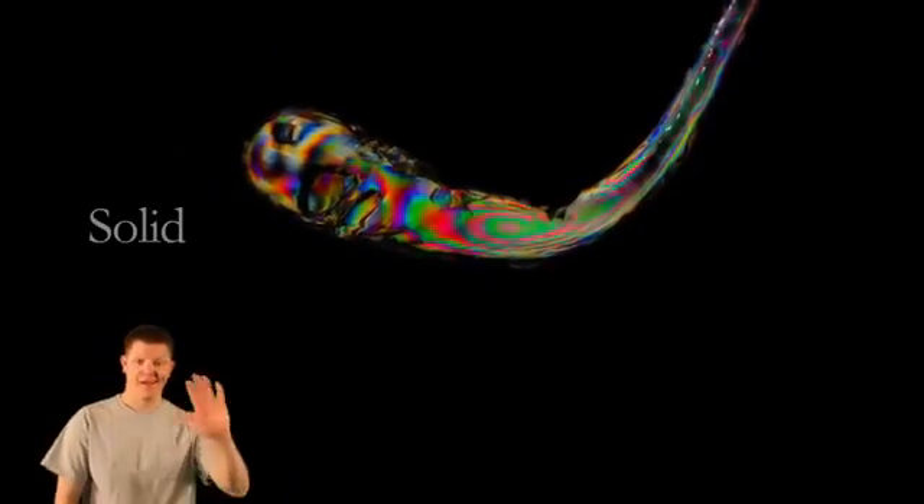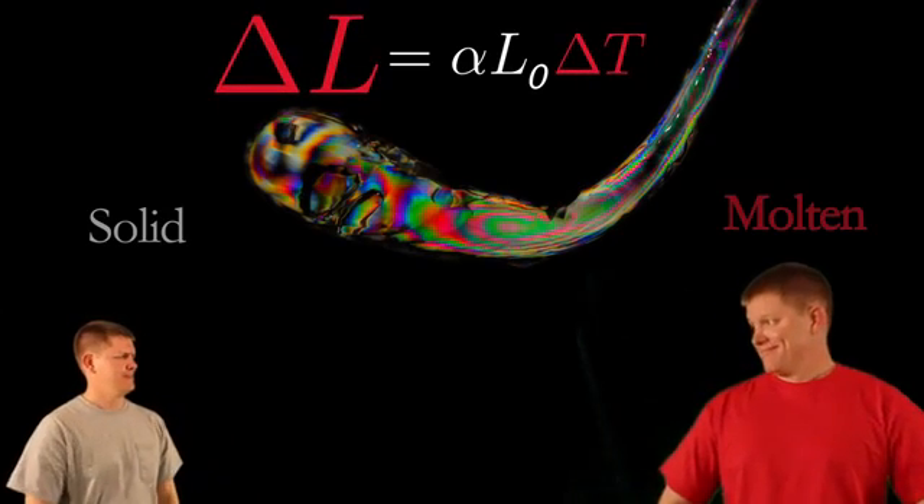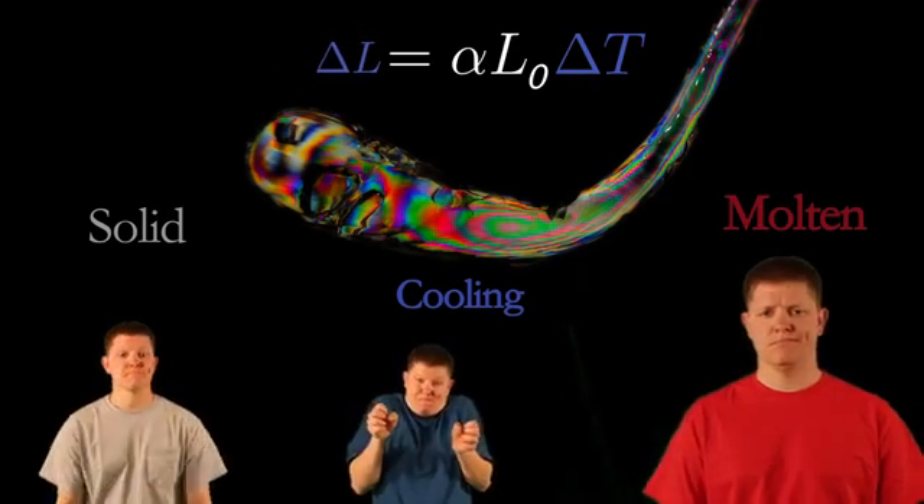To understand how these stresses got here, let's use the color gray to represent solid glass, red to represent molten glass. Because of the thermal expansion coefficient, the higher the temperature, the larger this glass wants to be. Blue represents glass that's cooling off or transitioning between the two states — this glass is shrinking and pulling in on itself. When the molten glass is first dropped into the water, the outside layer immediately solidifies, locking in the outside shape. The inside of the drop, however, is still a hot expanded liquid. As heat transfers to the water, the glass inside slowly cools and pulls in against that outside layer. Because it's already locked in as a round solid, it only compresses tighter against itself. This actually makes it stronger.